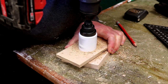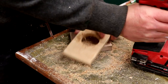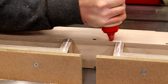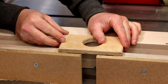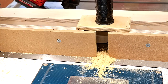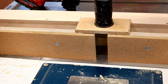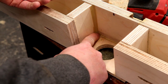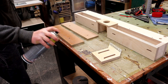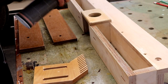After a good sanding I can fit the featherboard — this is going to be really handy when I need extra support for the workpiece to keep my fingers well away from the router bit. Dust extraction on this couldn't really be simpler. I just cut a top cap for the fence and drilled a 44mm hole with a hole saw bit right in the centre, which was just big enough to accommodate my usual vacuum hose. I glued and pinned it down onto the top of the fence and tested it out. It seems to work really well, but just to make sure it's properly sealed off I applied some silicone inside so that all airflow is directed to collecting from the router bit. Then I applied a couple of coats of spray varnish, de-nibbed in between, for protection and to keep it clean.